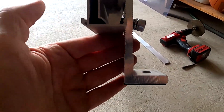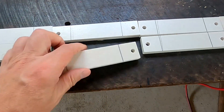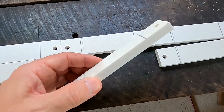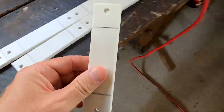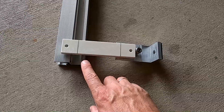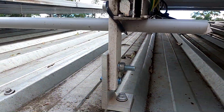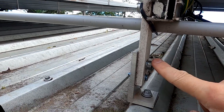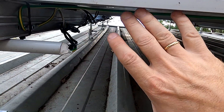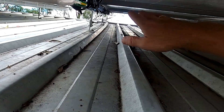This is basically the maximum height you'll get. If you've seen previous videos on my channel — some of the first ones — I have these fiberglass flat bars that are usually used for isolating bus bars, but I used them to extend the space between the rail system and the roof by about 140 millimeters or so. On my first stage of the solar setup you can see the extenders I put in between, and look how much room I have now — almost 200 millimeters between the panels and the roof.